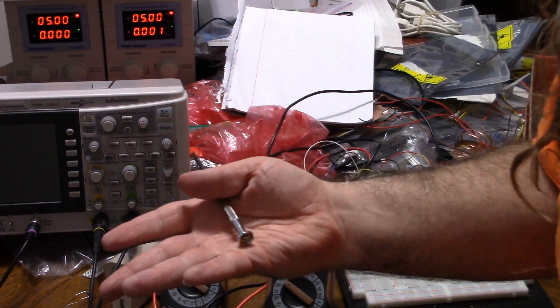The point is, it works — that is an op-amp precision diode. Obviously, you'll want to be careful: it's not a diode, it's using a diode, so you can't just slap it anywhere you'd put a diode — sometimes you can, sometimes you can't. This precision diode works perfectly as a half-wave rectifier. What about a full-wave rectifier? Not for power — you're going to spend more power than you save if you try to reduce wastage in a power supply; for that, use a very high-quality switching power supply. But for a signal — that's an idea for next time. I'll be seeing you.